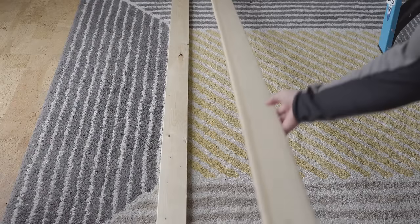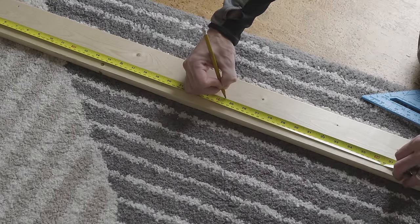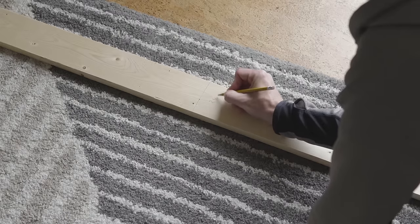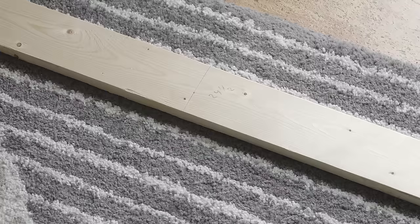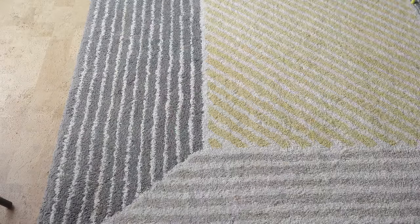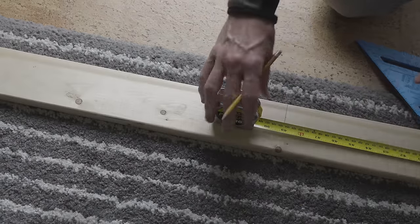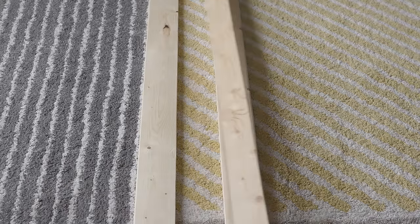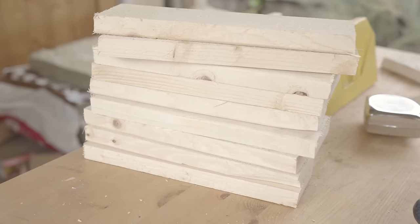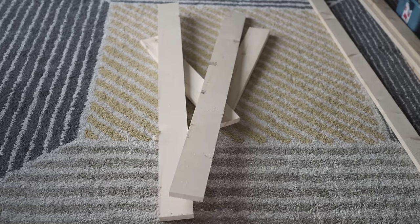Let's put together a panel. I'll start by creating the basic frame. Take one of the eight-foot one-by-fours, measure out 47 inches and make a mark, then measure out 24 and a half more inches and make another mark — what remains will be the other 24-and-a-half-inch piece for the top and bottom. Repeat with a second one-by-four. If building two frames, cut a third one-by-four into two more 47-inch pieces. Take the 10-foot one-by-three and mark off 23 inches twice for the back pieces, then mark every nine inches for the corner pieces. Make your cuts and you now have all the frame pieces.